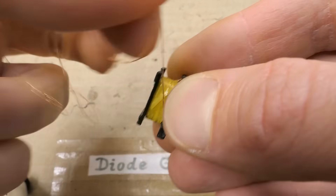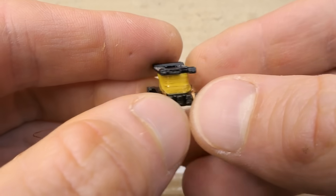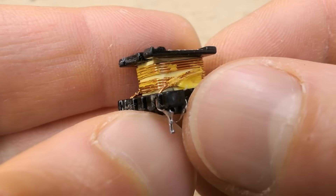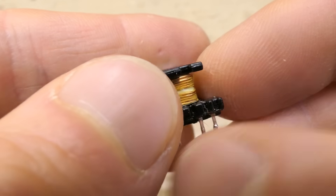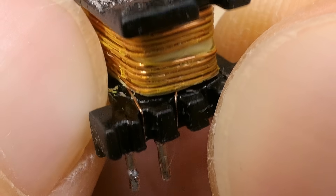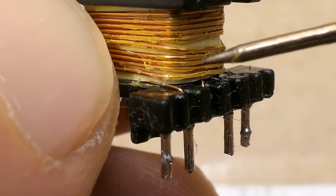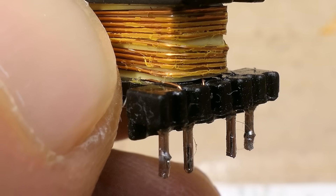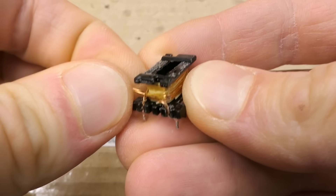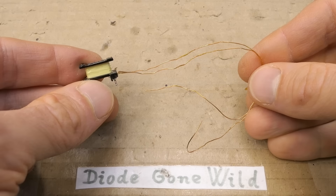Let's remove the auxiliary winding. Here's the insulation under it, which is sort of partially molten. Removing the insulation — one layer, two layers. Then the secondary made of two parallel wires. The secondary winding is extremely close to the ends of the primary winding. These thin wires are connected to the mains side and this is connected to the user basically. So if the voltage arcs over the tiny gap, or the wires touch and the lacquer on the wire fails, you get mains voltage at the output — basically in your phone or device.